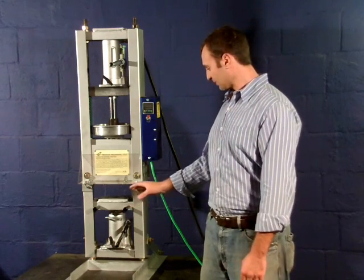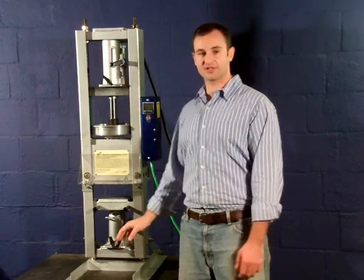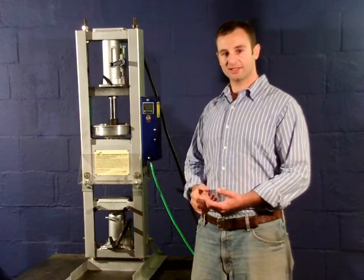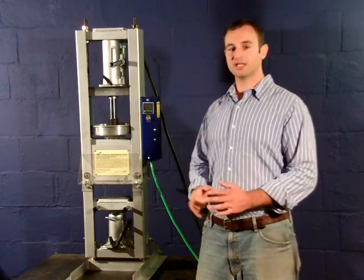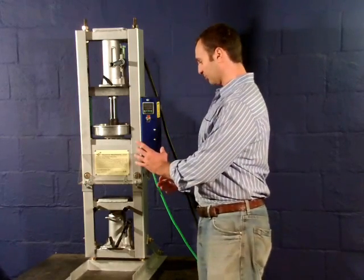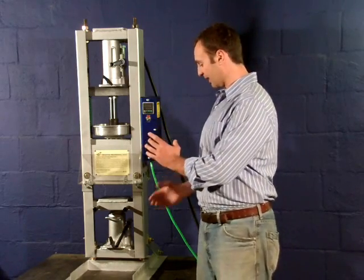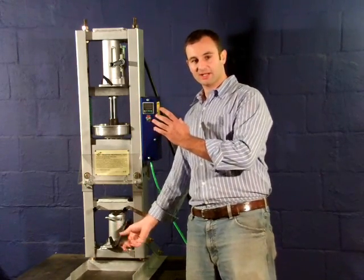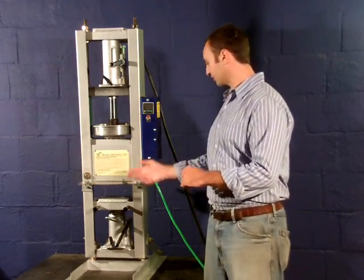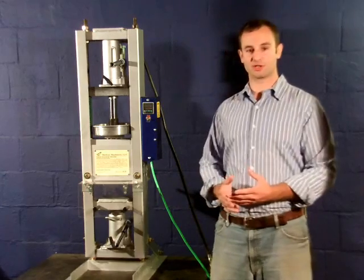There is a clamping mechanism comprised of another hydraulic cylinder just like the one on the top. The difference is that it is manually operated instead of air-hydraulically driven, for safety and also for cable overmolding. If you have a mold with a cable sticking out and hanging off one side, you would naturally want to hold it by hand so it wouldn't split under the weight of the cable. You hold it with one hand and tighten the clamp with the other, allowing safe operation with only one operator. There is also a safety shield to protect the operator after the mold has been secured.